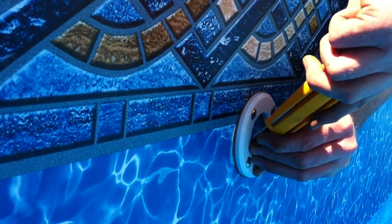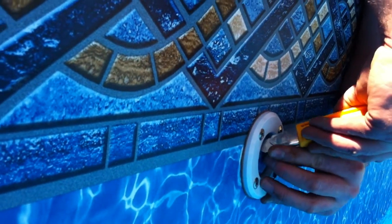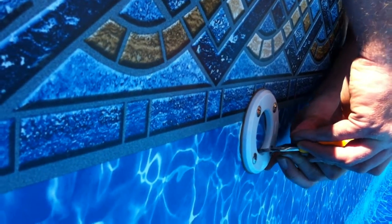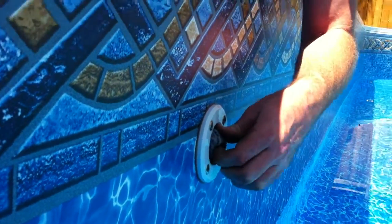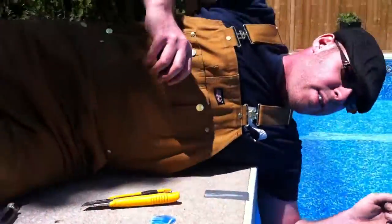Using a brand new razor knife so you get a nice clean cut. Be very careful not to let your knife jump outside of the return area and cut the liner, obviously. There we go. Now I use a little bit of duct tape in here — it helps with getting suction for the installation, so I'll take that out. And that is a jacuzzi return installation.